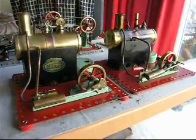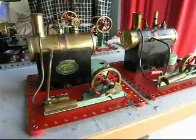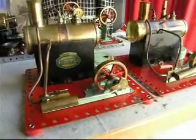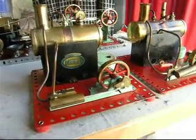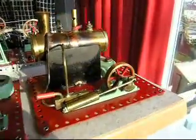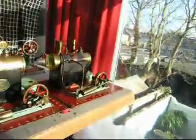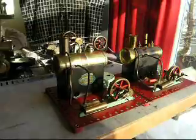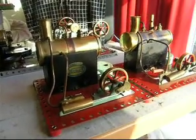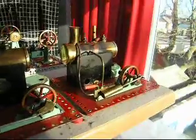These were most probably built at the Camden Street factory in central Birmingham. They've both got the later pressed steel engine frames, or the long pressed steel engine frames as they're known. These were cheaper to manufacture than the hot stamped brass variety, so as to keep them at a competitive price point. They still have the wonderful brass flywheels, and essentially they were both of the period where the engines were gradually moving into more rationalised, cheaper parts. I'd say they were still very attractive engines at the time.